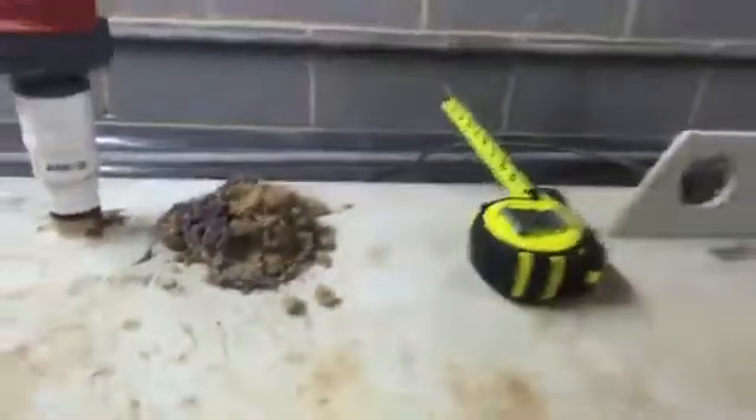What we're doing is we're backwashing because the filter in there was channeling — it was really, really bad. You can see what it looked like inside. That sand is what was in there, so we're hoping that our enzymes and our phosphate remover effectively removed a lot of that organic contamination that was sticking that sand together. They were having a big channeling problem, so we're hoping we were able to release that and the backwash is going to clean it up. We're about to go see after this backwash is done what the sand looks like.